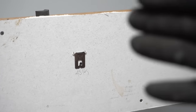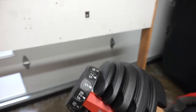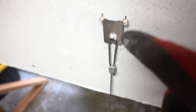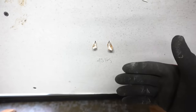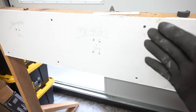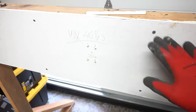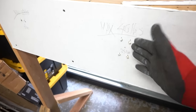Now at 52.5 pounds — maxing out my dumbbells. This is just for entertainment and test purposes, do not try this at home. It is suspended at 52.5 pounds. Taking a closer look — look how much it's starting to tear off the drywall already. And it snapped. Do not hang anything above 45 pounds on this. For myself, I would only go up to 30 pounds to be safe for this type of hook. There are many factors — drywall thickness, humidity levels, age — that will all affect the max strength of these hooks.